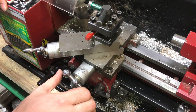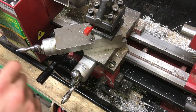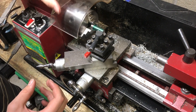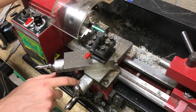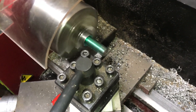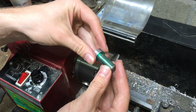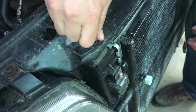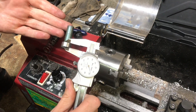If this were aluminum I'd probably just take it all in the same pass, but being steel I'm actually going to go three quarters of the way, and then just do the last five on the diameter as a finish pass. Actually, I'm not going to take off the full 20 — I want it to be oversized so that it grips into the rubber underneath, since it won't have a separate clip. So I'll start by taking off five, and then finish up with another two and a half, which should leave five thousandths on the diameter. I'll just check the fit right now and see how it is. Oh yeah, that's a nice fit — the threads are really grabbing in there. You can take it out if you need to, but it's not going to rattle out. I'm glad we didn't take any more off; that was a great fit.